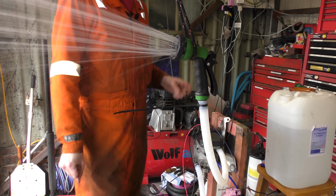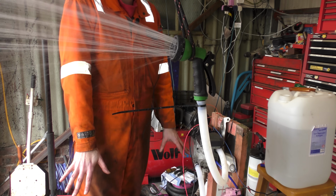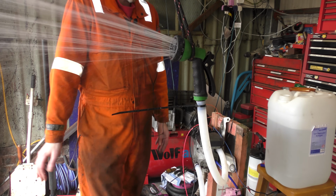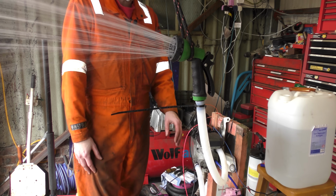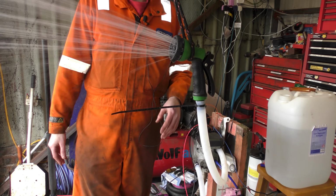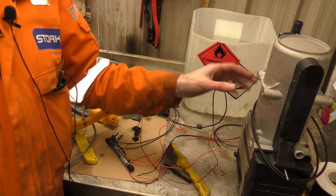I like that the Hungarian ECU, once you disconnect the switch, stops fueling entirely. That's it on stopping, cooling down. I like that. I'm not entirely sure if the Webasto does it as well, but I know the Chinese ones like to keep pumping diesel in a little bit more at the end, but I like that it just stops. And now I'll just let that run until it's finished, and then we'll have a little talk about the pros and cons of each. Well, both heaters worked.